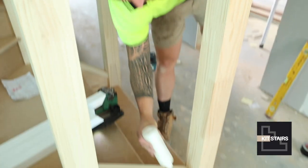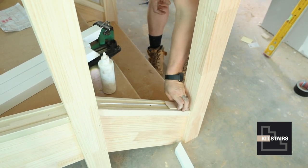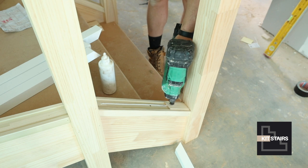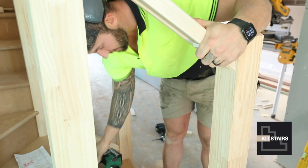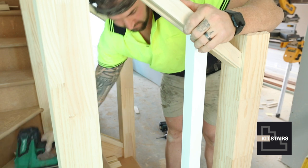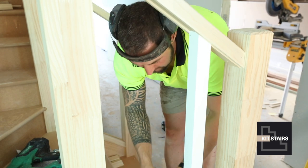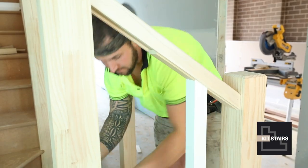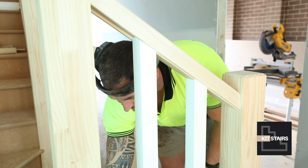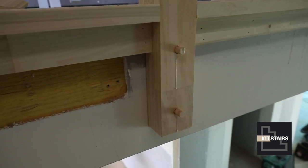For the infills, just run one strip of glue on those, then individually glue the tops, and then one fillet with a 38mm pin, just straining the channel. I always pin the baluster so there's no rattles. Sometimes you might have to trim the last fillet — you might have to trim one at the end.